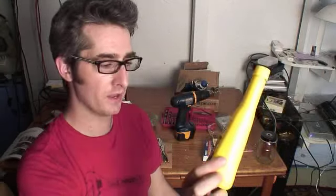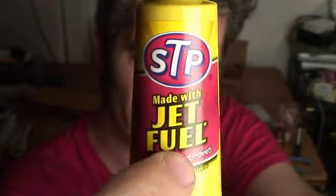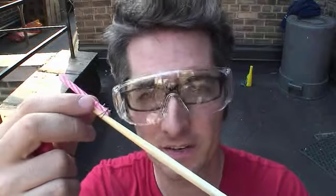Now I'm ready for fuel. Methyl alcohol is the jam jar jet fuel of choice. You can get this as gas line antifreeze — basically what this is is methyl alcohol. In this brand, they even say that it's jet fuel. Go ahead and stick the jar in the freezer for a few minutes before ignition; this will keep the jar cooler and hopefully keep it from breaking. Fire is dangerous and pulse jet engines are even more dangerous — your safety is in your hands. I'm wearing an extra pair of safety glasses and I've got an extension lighting device, because I don't want to get close to this thing at all.